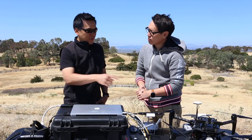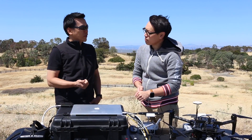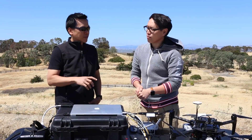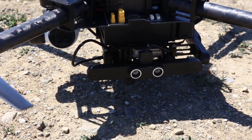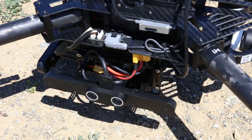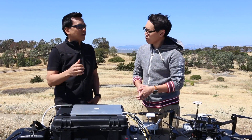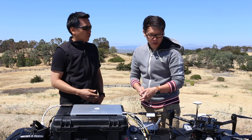So Guidance — you can see right here on the front and on all sides and also on the bottom. On the Inspire 1, we released Visual Positioning System, or VPS. That was ultrasonic plus optical flow — a single optical camera plus ultrasonic send-and-receive sensors. Now we have an upgraded ultrasonic system, much more powerful, and we also have stereo cameras. What Guidance gives you is the ability to see what objects are in front of it — it tells you that — and also gives you access to a depth map, stereo grayscale images, and ultrasonic information.